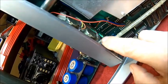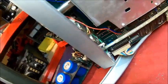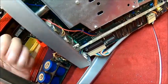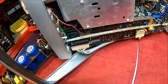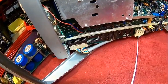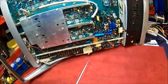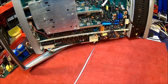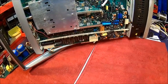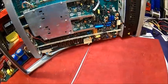Here's the faulty solder joint - one of these wires was just wrapped around but wasn't soldered. So there was always a problem: if you knocked it, it was working and then suddenly it stopped working. Looking at the scope now, it's actually in quite good condition - probably because of that problem it was just sat in the corner. The tube is crisp and bright.